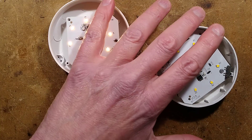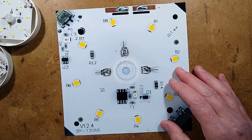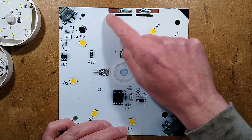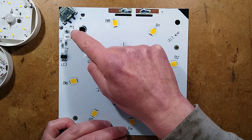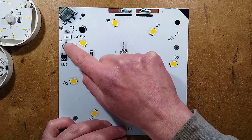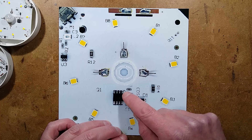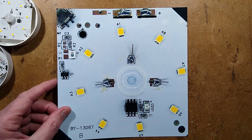Here's the standard circuit board — I've featured this in previous videos including a faulty one. The standard one has an extra switch, a diode, and the usual passive infrared detector with a dedicated chip. It's got a resistor for the LEDs to limit current. The charge circuitry uses a micro USB port with a little decoupling capacitor, two resistors for the charge chip — one sets the current at 4.7k — and a single LED that goes out when it's charged.